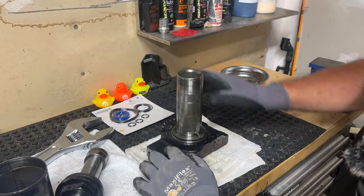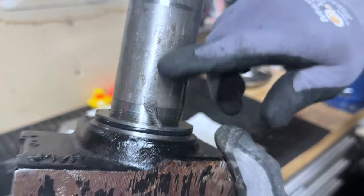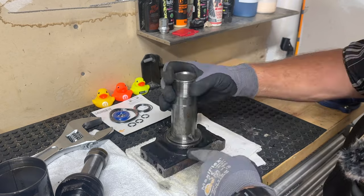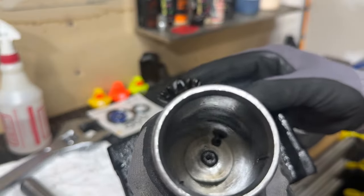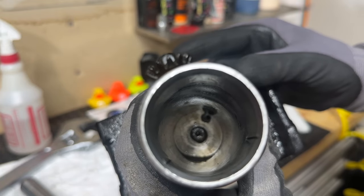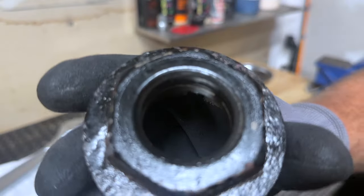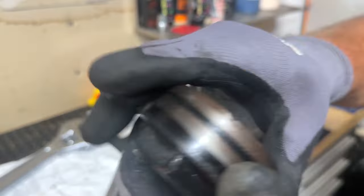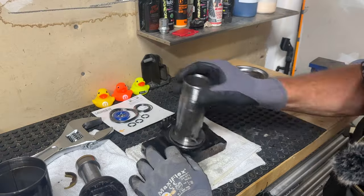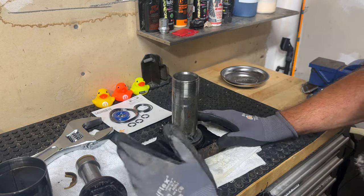There's an o-ring at the top. This body is just a machined, welded tube. There's a little filter right here — when oil goes back in through the power unit assembly, it screens out any debris. There's an opening that lets oil in when you pump the jack up to pressurize this cylinder. Now we can take this assembly off the ram — you can see there's another o-ring inside here that needs to be replaced, and an o-ring on the outside as well. I'll put a little air through here to clean it out.